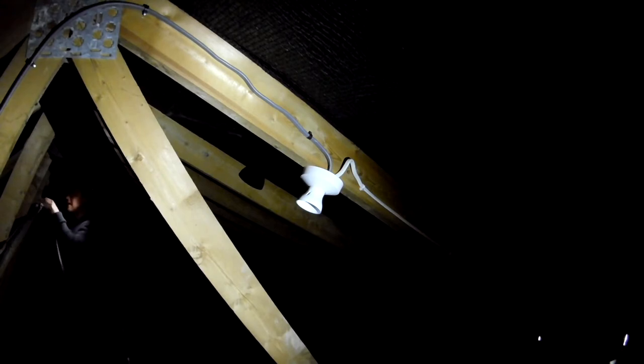Let's put the next light fitting here, I think. I guess this might not be making for the best episode yet on my channel, because you probably can't see what I'm doing very well from where the camera is. I'll move it along a bit. So I want to mount this on here, basically about there. There's one screw hole there and one there, so I'm going to pilot drill those. Well, I can't go the entire episode without using any power tools, can I? I think there's more light coming from this drill than from the actual torches I've got set up in here. I'm happy using a manual screwdriver here, partly because I'm only doing two screws, but also it gives me a bit more control and it's easier to get into the small space inside the junction box of the light fitting.